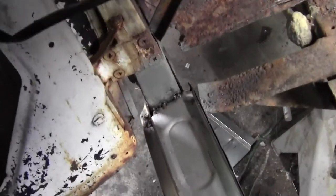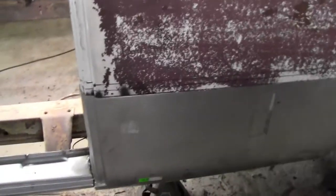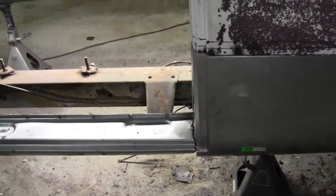Of course I've got to go back to work tomorrow, so there's that. Anyway, what I got done yesterday after I stopped was I went ahead and got the inner rocker panel put in, and the outer rocker panel put in, and got the line looking pretty good. It's a little higher in the back than in the front, but I don't think that's going to be too much of a problem. I put the lower part of the fender in and it's going to have to be trimmed to finish.